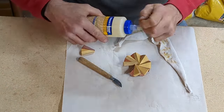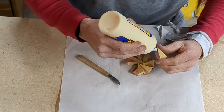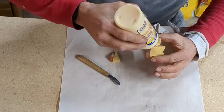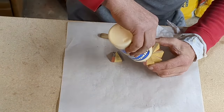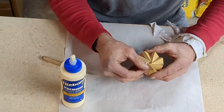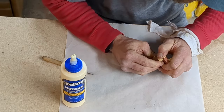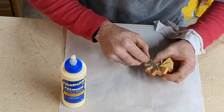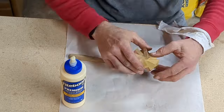And our last pair to make our foundation ring. I call this our foundation ring because it has to meet three requirements in order to keep building off of it. All your lap joints have to be flush from the outside in, for one thing. You have to have 90 degrees on every lap joint. And final, all points must touch a flat surface when sat down.